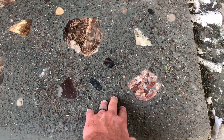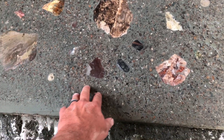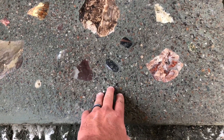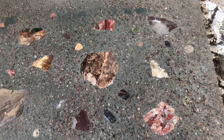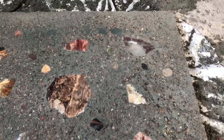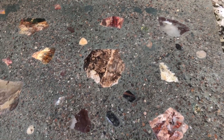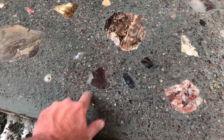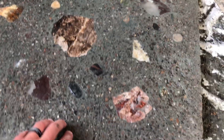On this one I'm going to be able to see a lot of the small aggregate — it's not chipped out a lot of them, some but not a lot. I am going to re-grout this one and then polish it again because it's not real smooth, and it kind of has to be fairly smooth before we can seal it. It's definitely not smooth. A couple tips: don't do this if you don't want to make a mess — it's super messy.